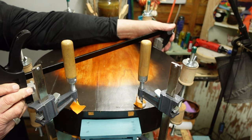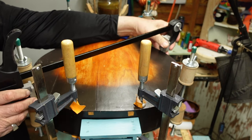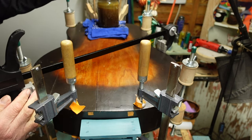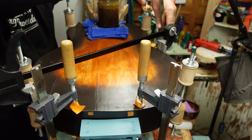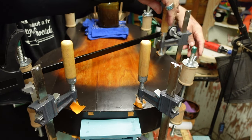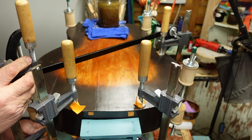So let's say that this side is okay here. I'm going to put the flat edge of that clamp. You see there's a little groove in it too. I can put it there, and if I need to pull in the other side, I can just do this until it goes in. Now sometimes the clamp is going to want to slip. So if I go over on this side and put a clamp over here and push this down, I can give that clamp something to lean against where it won't slip, and do the same thing over on this side, like so.